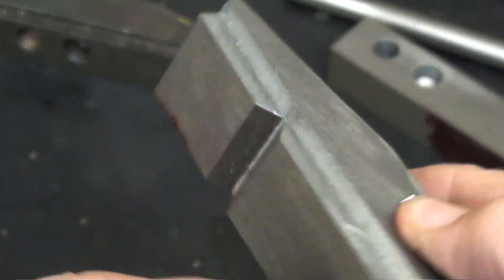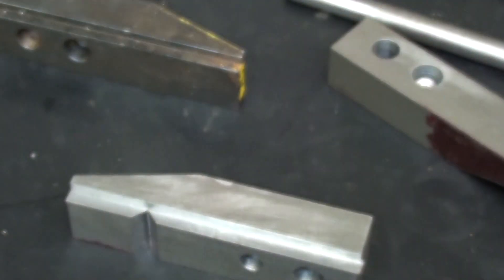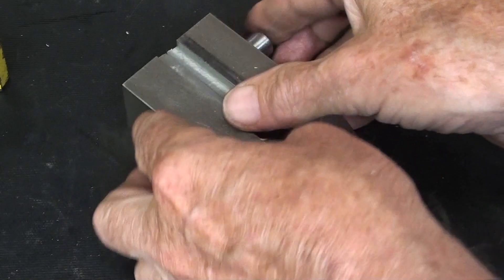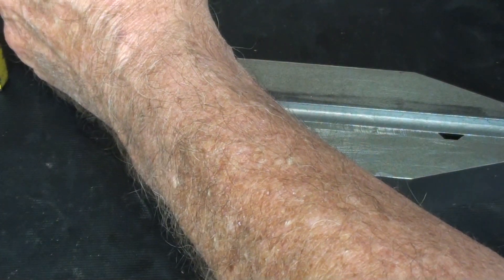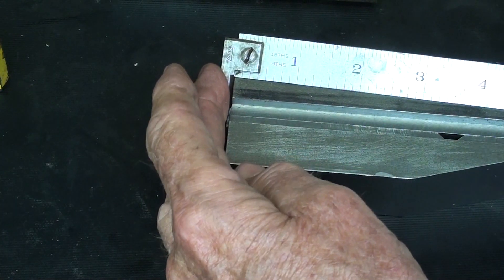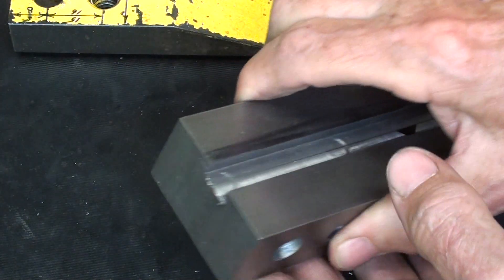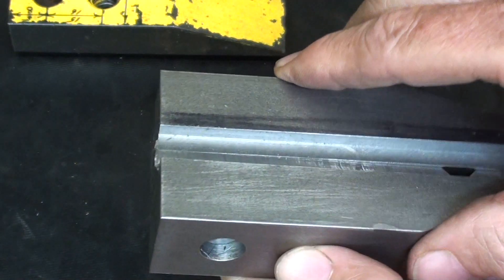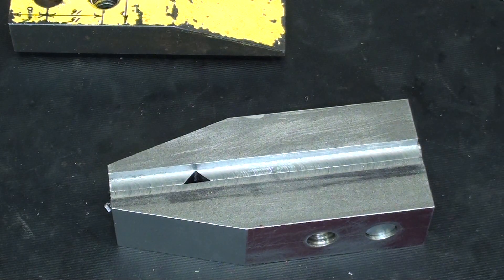That's looking pretty good. Other than milling these to the correct length and a little bit more deburring, the two jaws are actually done. That's really the hard part of the project — the jaws. I'm going to pin the two jaws back together for alignment. Rather than attempting to mill them to the correct length — four and five-eighths, and at the present I'm four and three-quarters — I'm going to attempt to belt sand them on the big sander, holding them up against a nice miter gauge. Let's go over to the Delta.